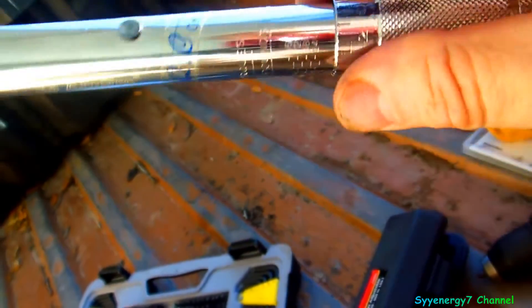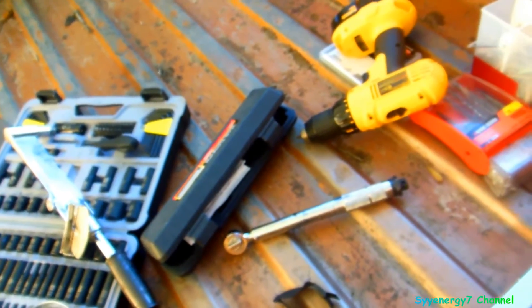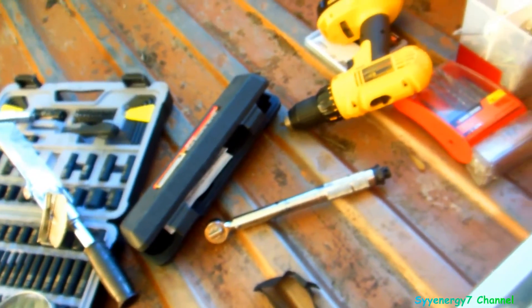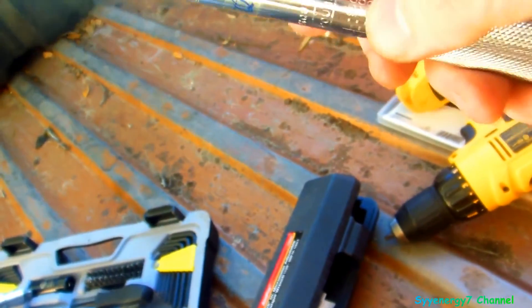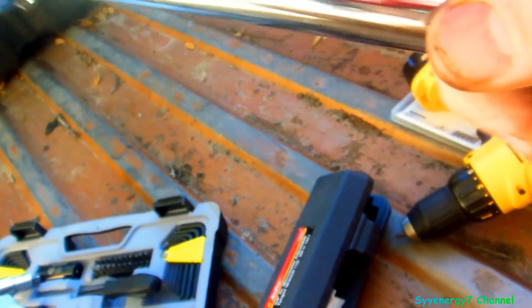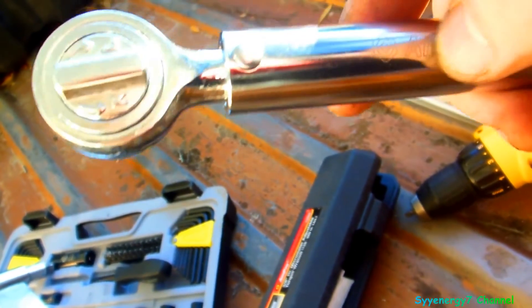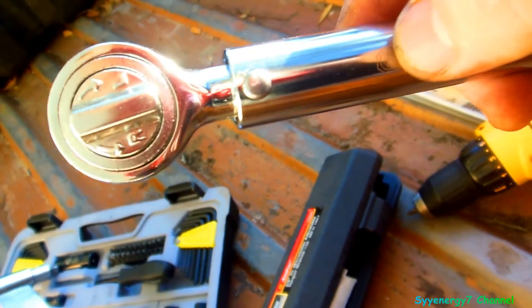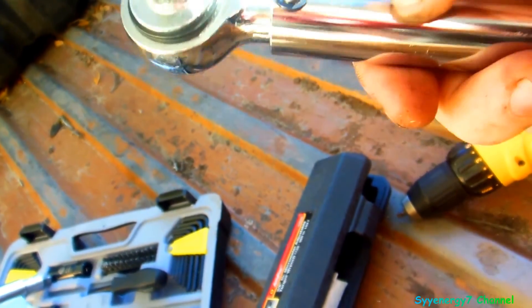The wrench was only about $27, but now that I can actually use it with a correction factor, it's worth keeping. I've already marked the zeros in black because this thing is really hard to read. I'll wrap a tape tag around the handle that says: '120 inch-pounds on this handle is actually 240 — add 120 inch-pounds to the reading.' Now I know what the problem is and I'll just use it that way.